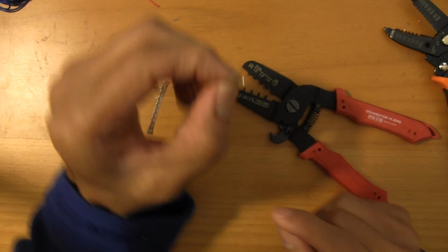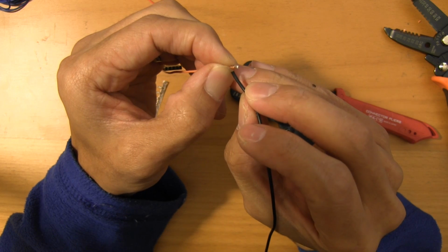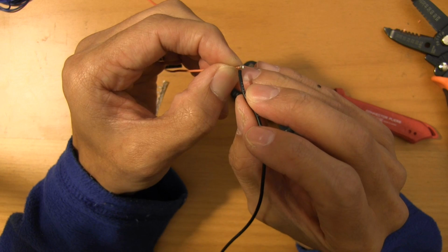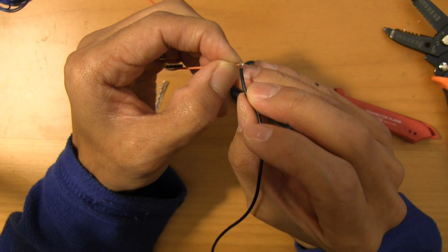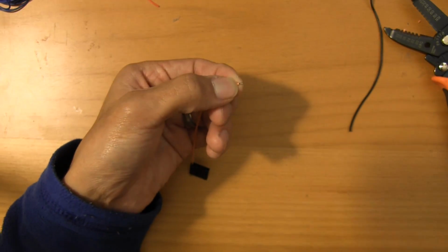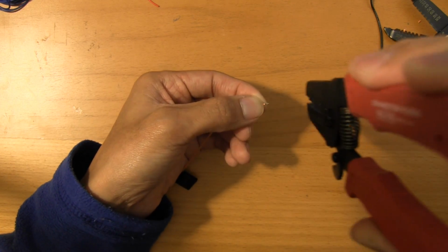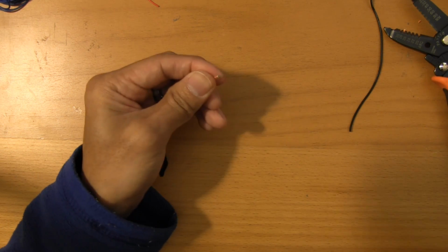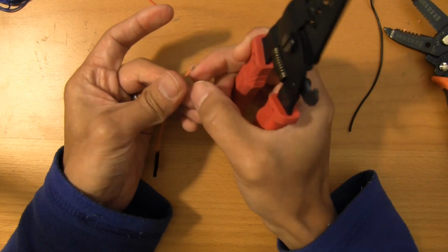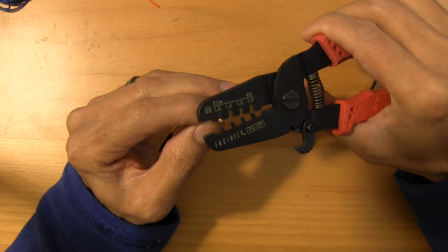And let's see there. I don't know if you can see this, but I've got the shoulder, I've got the arms that grab the outer coating, and then the outer coating that stops right at the area of the crimp that connects with the actual wire. So I've got this plugged in between 2 fingers, and then I'm just going to go in and crimp those arms really softly. Now on a scale of 1 to 10, with 1 being barely enough pressure and then 10 being Herculean effort, I would say that, come in with about a 5. You want this part to be very delicate.